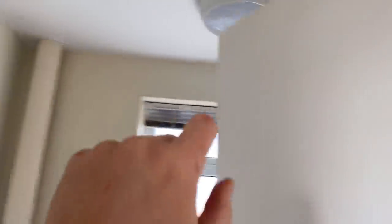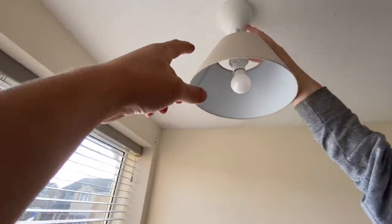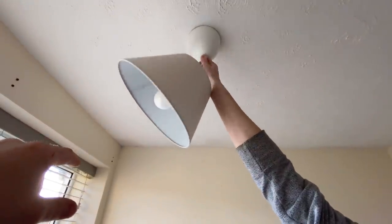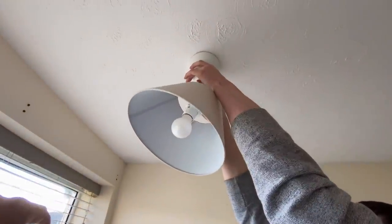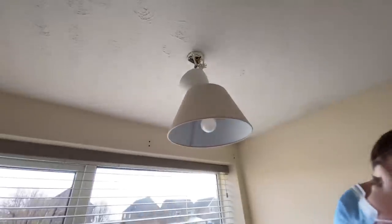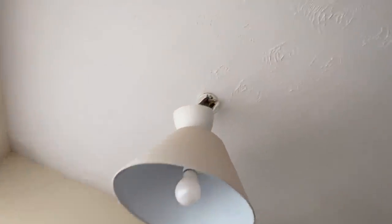We've got five lights up here, nice and simple — a bulkhead. As I was saying to James, if I wired this I'd come from the fuseboard up through here, so hopefully we come through these rooms and end at the line. Unscrew that middle piece — it's an IKEA fitting — let it drop down. How many cables? Two or three? We've got three — loop-in, loop-out and switch lines — so this isn't end of line. Leave it down and check the landing. It's great having James.